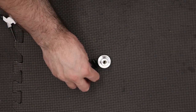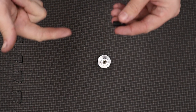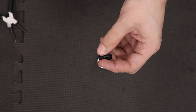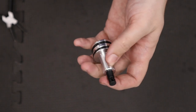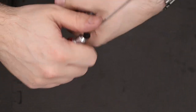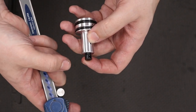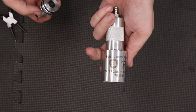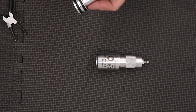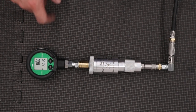The last thing we'll do is add the adjuster screw — this piece has been polished off-camera and we also polished the tip of the regulator piston. These two pieces seal on one another so they need to be a nice smooth surface for the seal to work effectively. We can get that screwed into the top and then use something like an Allen key shaft to get it screwed in. In the disassembly video I encouraged you to take a measurement from the top of the reg body to the top of the adjuster screw so it's easy to set it back before you pressurize the rifle. I've made myself a regulator tester so I'll set the reg pressure off-camera. The regulator is set to just over 80 bar — I do expect that to drop slightly as it beds in so 80.8 bar will be fine for now.